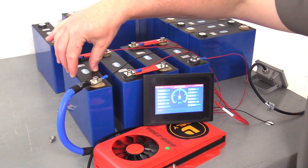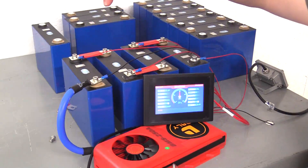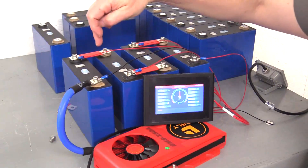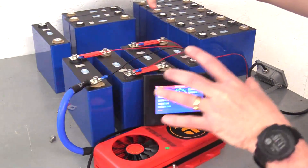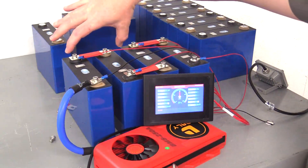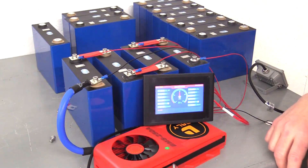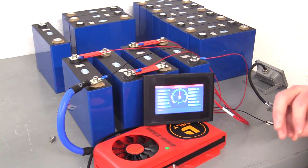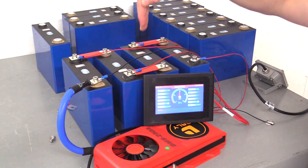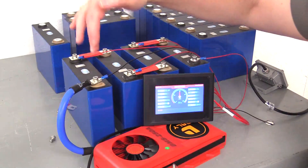In this little configuration, we just made a little 12-volt battery with four 3.2-volt cells. You also need to make sure your bus bars are all going to be of equal size. In the ones we made for our house, we actually had to toss the bus bars out because we were making a 48-volt system and the layout didn't allow the bus bars to give everything equal distance. For purposes of keeping the batteries all charged and discharged equally, you've got to have those at the same length — so we actually made our own bus bars.